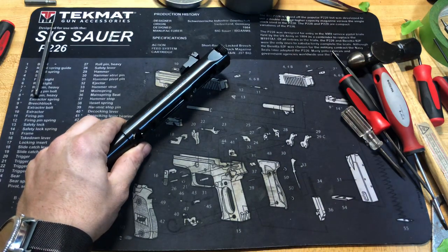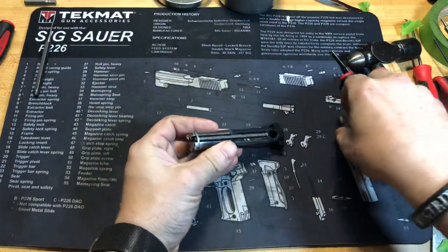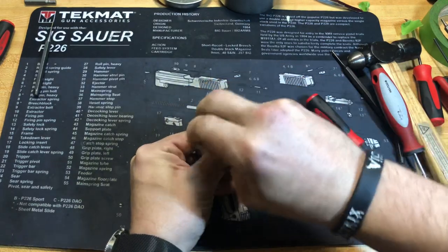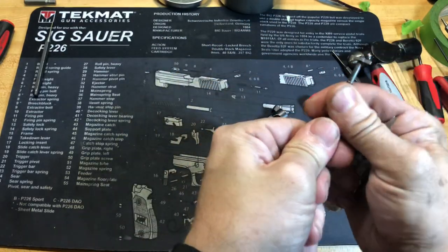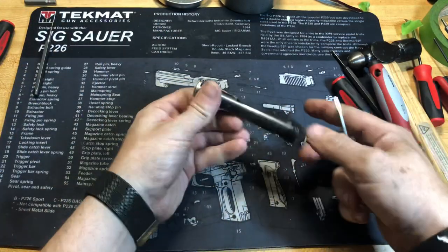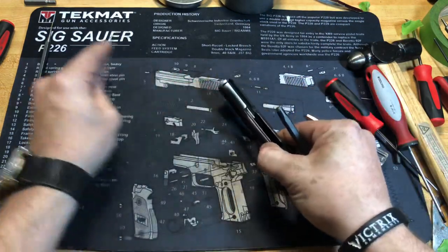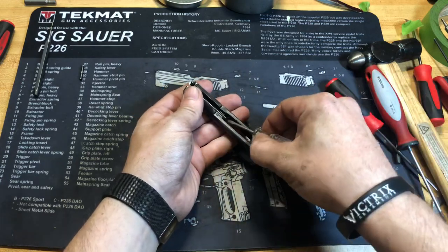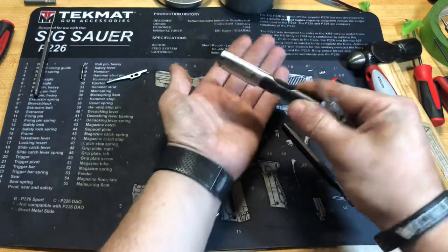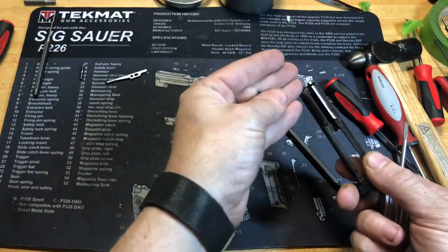Put the lower off to the side for a second and pull the bolt. To start on the bolt, you're going to remove the mainspring — it just pops out of there and it's all captured, studded on this end. If you want to remove the firing pin, push this pin out and put it off to the side, then your firing pin will slide out of there.